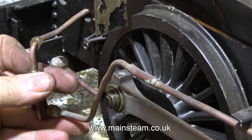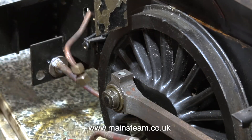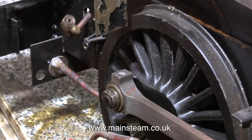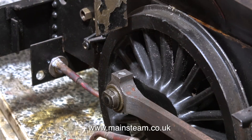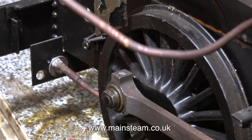In this episode I'm going to show how I remove the boiler and smoke box as one unit from the frames, and this one unit is very heavy. Once I start to lift the heavy boiler off the frames I need it to come away from the engine completely and very easily. So now's the time to remove any connections between the boiler and the main frames of the engine.